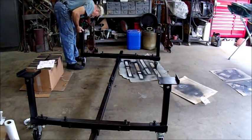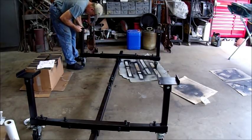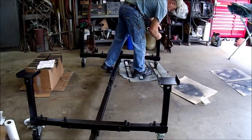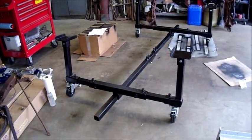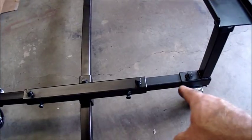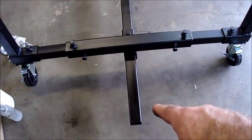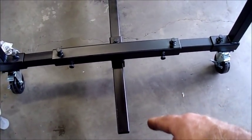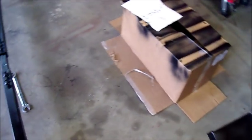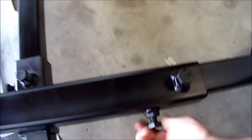It's a little flimsy, but that's it — pretty simple. Like I said, you can adjust this leg in and out. You can even have that piece sticking out of the end over here if you need to. Of course that will go in further towards the center. If you really wanted to, you could probably cut off the end of these tubes if they were sticking out too far. You can't do any height adjustment. It's sitting all crooked right now because none of these bolts are tight, so just snug up these bolts a little bit and we'll square it up pretty quick.